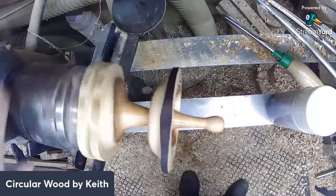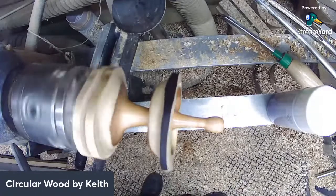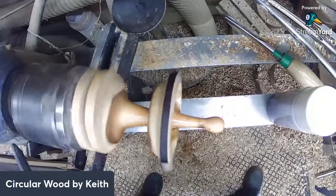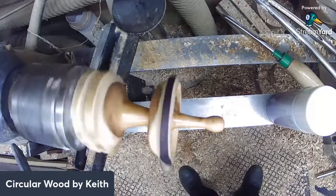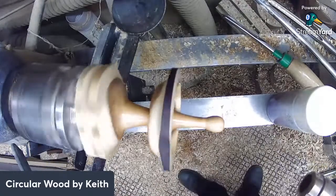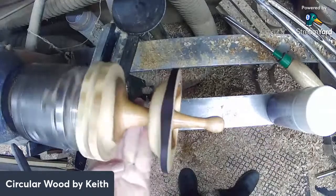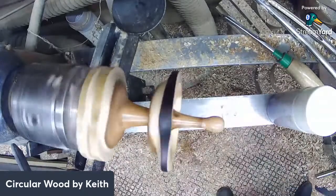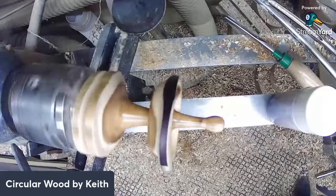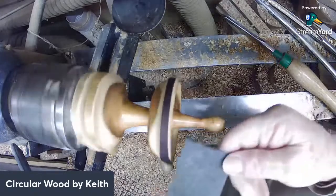It's not that warm in the workshop tonight, so it's not drying that quick. It's warm enough for me to work, but it's taking its time, the widest bit. Nearly gone. Right, that feels like it's gone. So we've got cellulose sanding sealer on there, so I'm just going to lightly knock that back with a bit of 1600 Webrax pad.